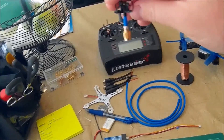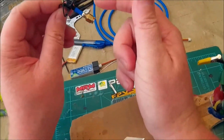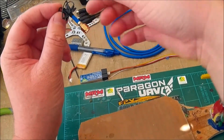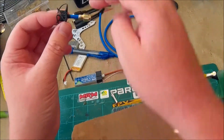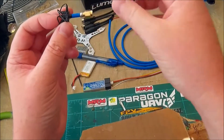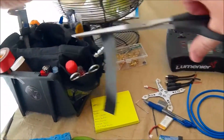You're done — now you can add some heat shrink. One thing I don't like about this approach: when I make antennas I start with the connector first, soldering to the RG402, then do the antenna part after, so I can slide heat shrink over it and make it nice and pretty. But doing it this way, the heat shrink has to be big enough to fit over the connector and then it's too big to shrink down onto the cable. So what I do is just put a small piece on, sometimes wrapping electrical tape around first. Electrical tape also makes it stronger.